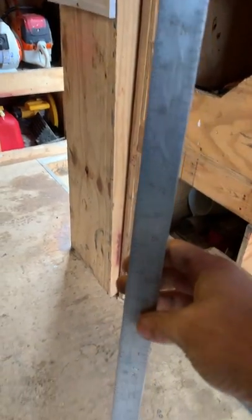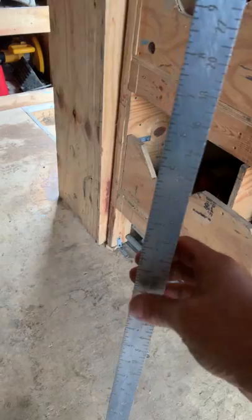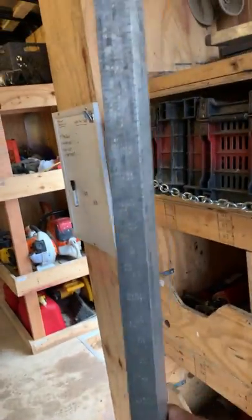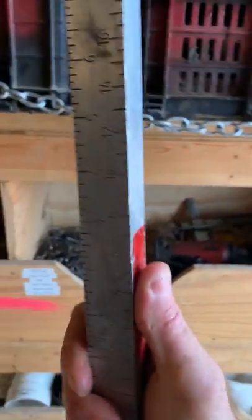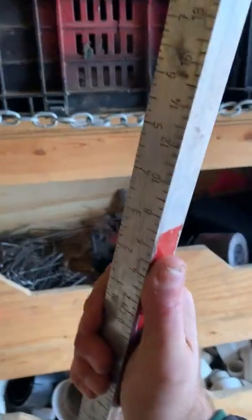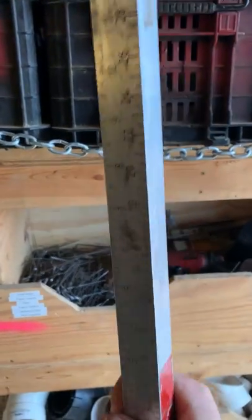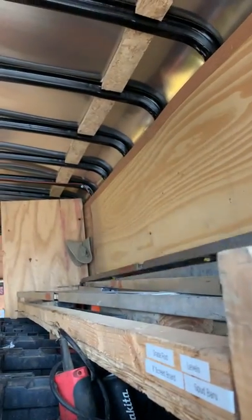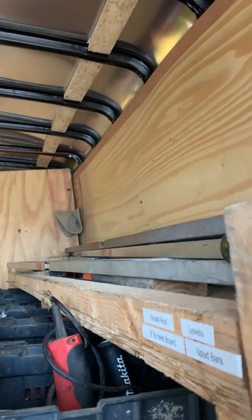You're always setting everything off zero — if you know your threshold is at zero, you set your grade there, and then you can set your excavation at negative nine. Everybody's on the same page and working together. It's just a lot less headaches — trust me, spend the money and get that thing. Eight-foot, six-foot, and four-foot levels — a bunch of levels up there and they stay. We haven't had them fall out.